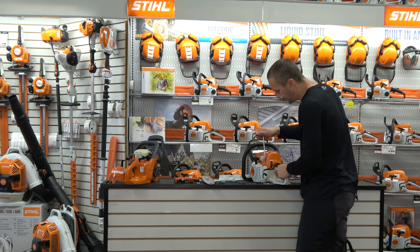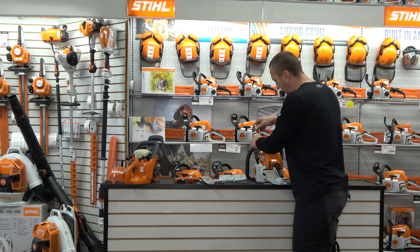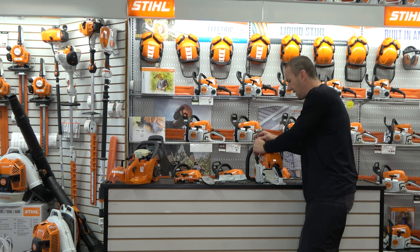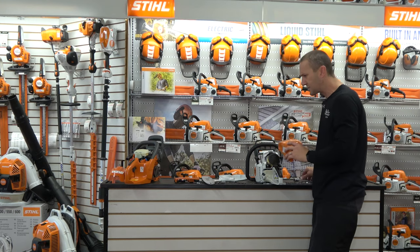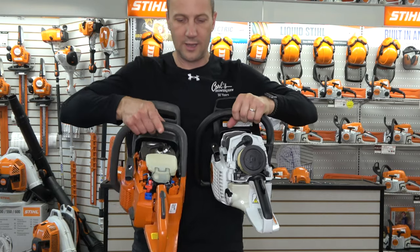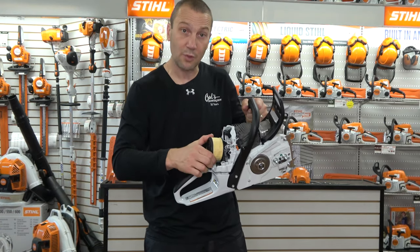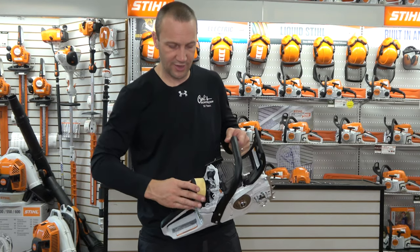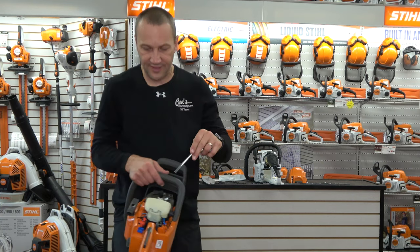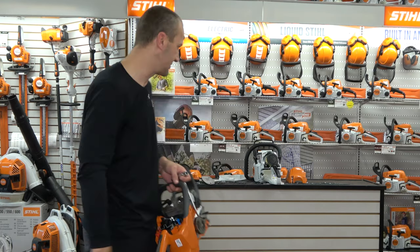The adjustable oiler is an advantage that Husqvarna has. On the Stihl, the air filter is a nice cylindrical piece that screws on and clicks in place with a rubber mount that keeps dirt from entering the carburetor — an awesome filtration system. On the Husqvarna, I need my screwdriver again to pop the clip off to get the air filter out. The capacity and access of the Stihl's air filtration system is better — win that one for Stihl.